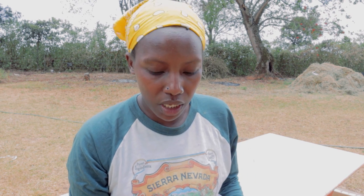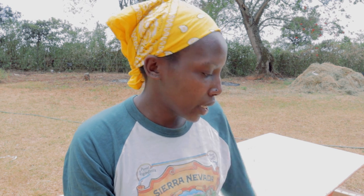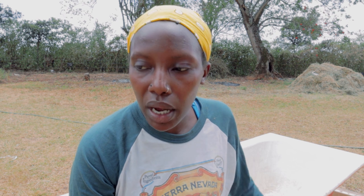We've sanded this again, using water this time. My brother started using water — it's getting cleaner. We've decided we're going to apply mordant one more time, let that dry, rinse it off, then do it a second time, then a third if we have to. What the mordant will do is prep the surface for the primer. If we don't apply it, apparently the primer will not stick to the tub. And then the paint on top of that will stick to the primer. So the mordant prepares the surface for proper adhesion.